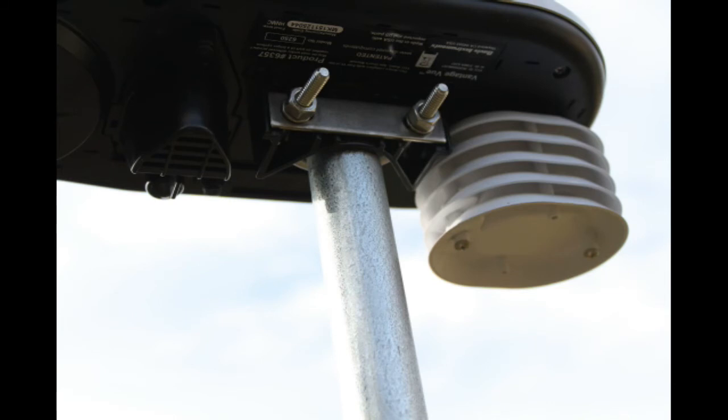My installation details. The rest of this video will describe the details of my installation. Hopefully many of the steps will save you some time, and the others can be adapted to suit your particular situation. The weather station needs to be mounted between five and seven feet up from the ground on a pole, and needs to be reasonably far from any buildings or large asphalt surfaces that would give off heat.